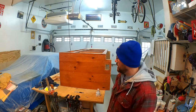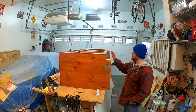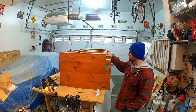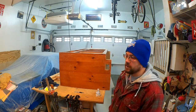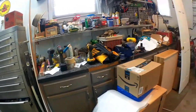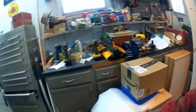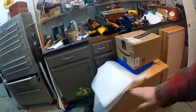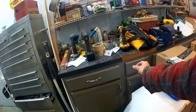If you didn't have a cabinet this long and wanted to create something longer, you can stack multiple cabinets together and attach them to a three-quarter-inch piece of plywood along the bottom. My current workbench was actually my brother's old kitchen cabinets — two separate cabinets joined together. I took a piece of three-quarter-inch plywood, cut off the toe kicks, set them on the plywood, screwed into the bottom, and screwed the cabinets together.